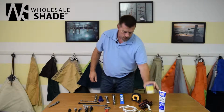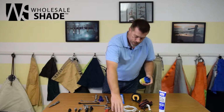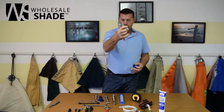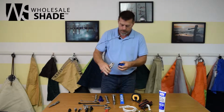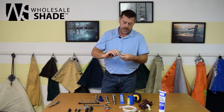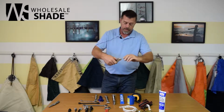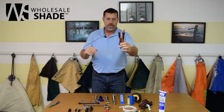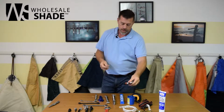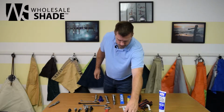And then the safety wire, keep this. These are like $8. Just go get a couple of them, throw them in the box. As you're tie wiring your turnbuckle, a vice grip with the cutter is what I use. That way you can cut the wire and then twist it with the vice grip. I'll say it again, I recommend keeping this pair of vice grips. They're pretty handy. Keep it in your toolkit for the shade sails. And get the one with the cutter in it.